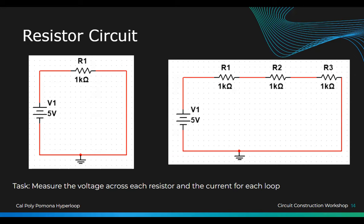Okay. All right. So the other end is connected, right? We follow the rail. It's connected to the negative side. So what I'm going to do, you could put it directly to the negative rail if you want, or you can just place it on one of these terminals, and then you can just jumper it to the negative side using another wire. So by using another wire, I can put the resistor on one of the rails, stick a male jumper wire and just connect it straight to the ground. Now I'll walk around and show you.